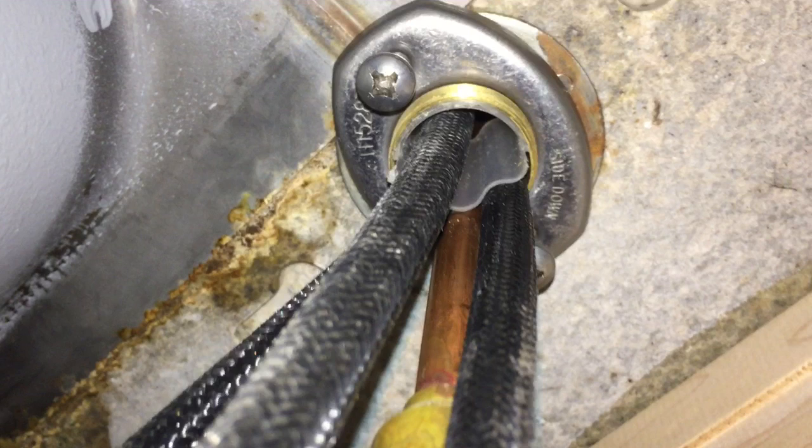And that's the whole purpose for this, to give you a way to tighten everything while finally controlling the centering. If they didn't give you that top washer with the screw holes, you could still tighten it down just by hand or with a tool with a big oblong washer, but as you tighten the big oblong washer, you'd end up inadvertently spinning the faucet no matter how hard you tried not to. And so that's the whole purpose for this sort of two-way mechanism to tighten down the sink.